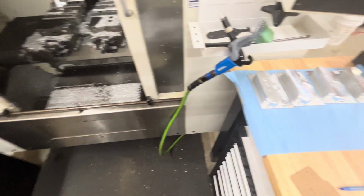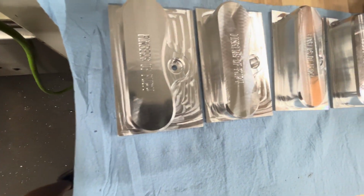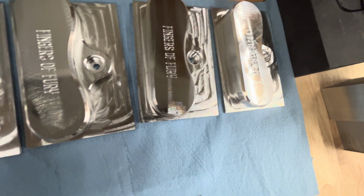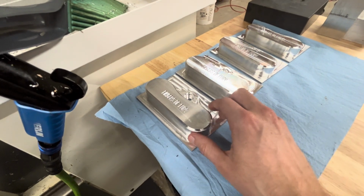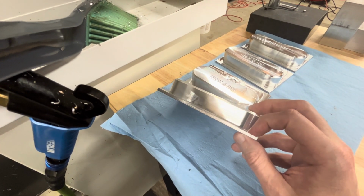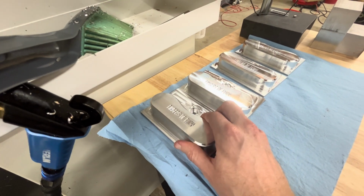So flip it around. We've got the Baby Boss boards here. These are half machined. This is op 1. So you can kind of get an idea of what it looks like at this point, the outline of the stock. These have maybe 150 thousandths of stock here. Would that be like 4 millimeters or something like that left?